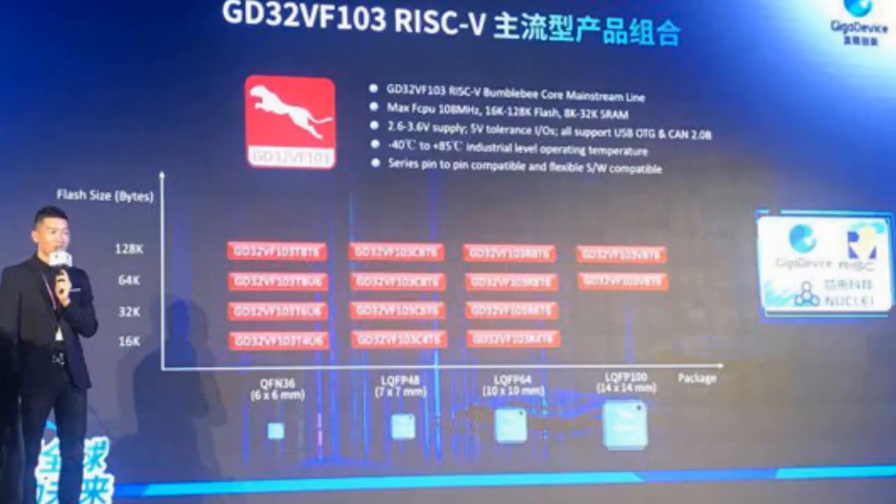We're still watching for a RISC-V device that has lots of RAM and USB. Getting closer — this one has a little bit of RAM but does have USB. This is the Giga Device GD32V RISC-V. We actually use their QSPI flash on our boards — high quality stuff, also used by Espressif. They're well known for making STM32-compatible boards, and this is similar but uses RISC-V. It has native full-speed USB, but not enough RAM yet — we need around 64K or more for CircuitPython. We joined the RISC-V Foundation and have some RISC-V Feathers planned.